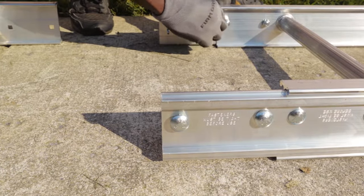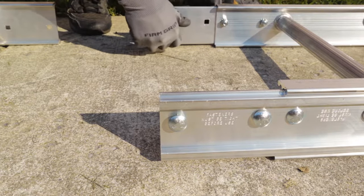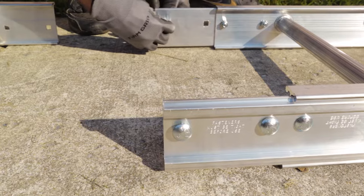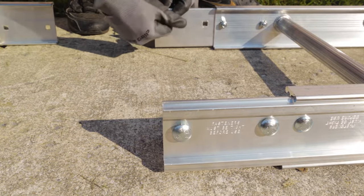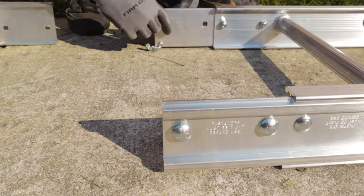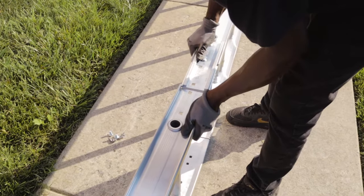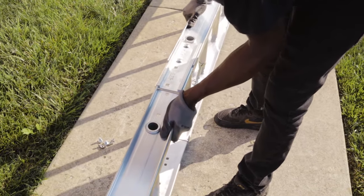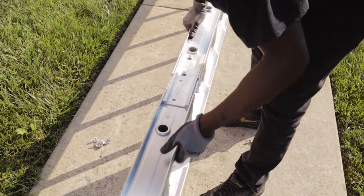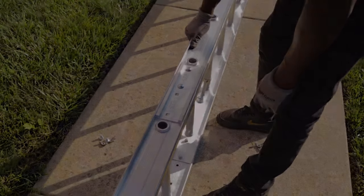The track sections are to be installed using the pre-installed splice plates. Uninstall the outer hardware and the splice plates to get started. The square holes on the splice plate should line up with the holes on the track. A trick to help slide the track sections together would be to lean them on their side and insert them as shown.